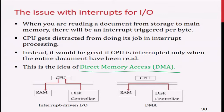Even though you are moving so much data between your PC and your hard disk, you still say that it's such a trivial thing, correct? Moving data from place A to place B should be a very trivial thing for a processor. Why must my system hang because of that? Okay? So in order to do that, what we have in microcontrollers, again, this DMA feature is not in all microcontrollers. Those low-end, entry-level ones will not have this. Those mid-range and above will have this.